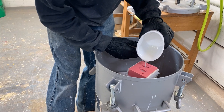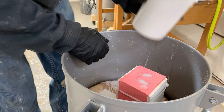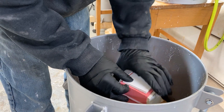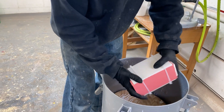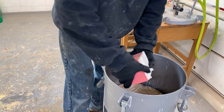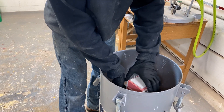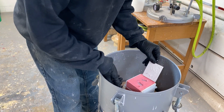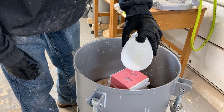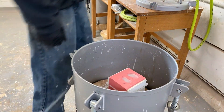Now, as soon as he gets that in there, this next step kind of depends on the shape of the piece in the mold. He's going to seal that bottom off and pick it up and rotate it. What that's going to do is allow the resin to break surface tension on any little finger areas or tight spots where it might be stuck. Surface tension will keep an air bubble against the wall of the mold and the resin won't get into that area. By breaking that surface tension, it's going to release the air, and then the pressure casting will be able to squeeze that air out.